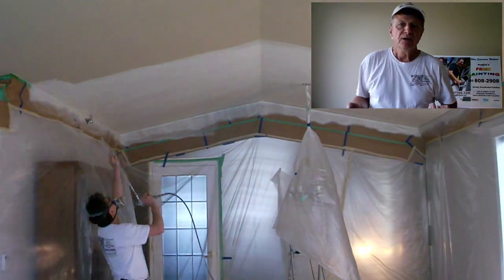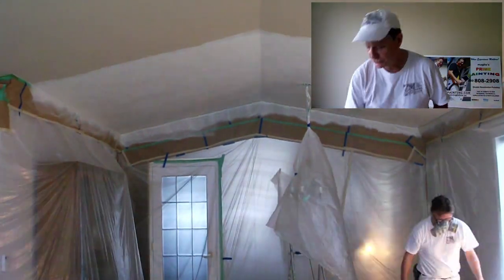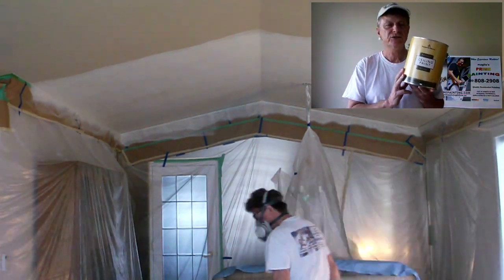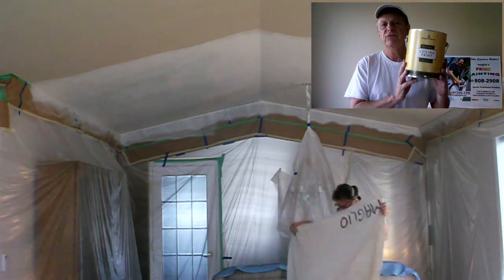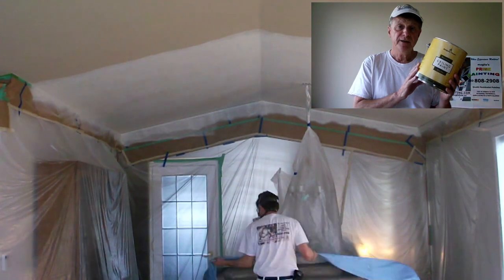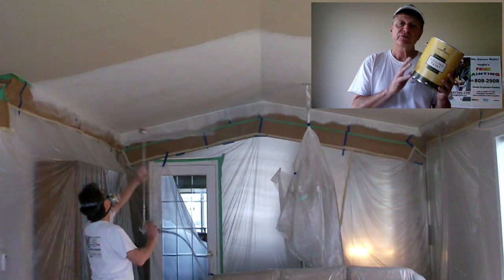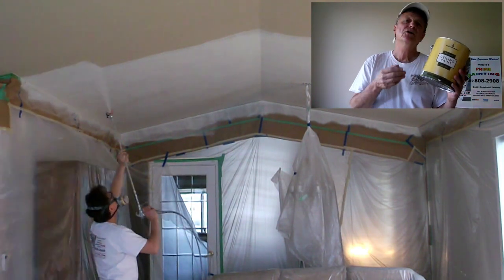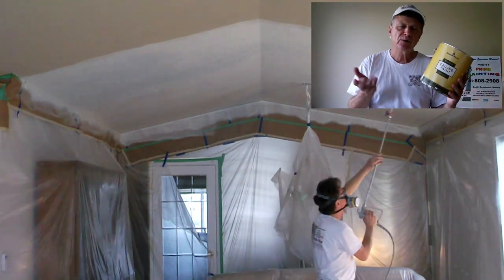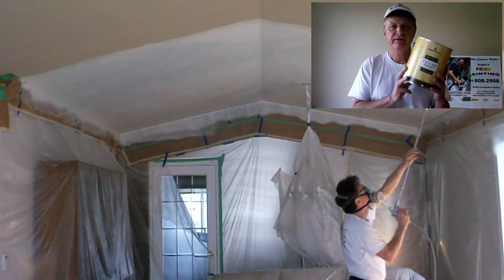So now that it's already been sealed the damage is done, and I'm going to do two coats. I'm using Benjamin Moore Ultra Flat Ceiling Paint — it's totally awesome. The reason it's awesome is it's a heavy-bodied paint and it dries really quickly. But most importantly, it's completely flat. Dead flat. So if there's any imperfections in the ceiling — like a crack that might have been caulked, something that might have been fixed, or an older ceiling where the drywall might be irregular — this is the paint to use, because it really does hide a lot. Very, very forgiving.